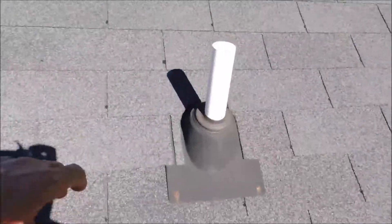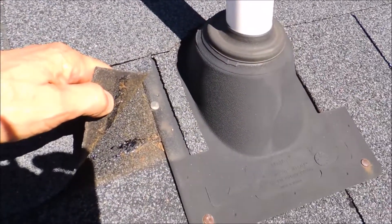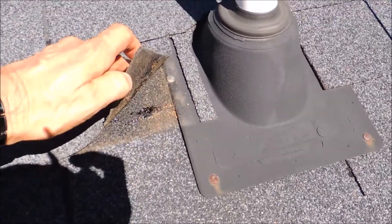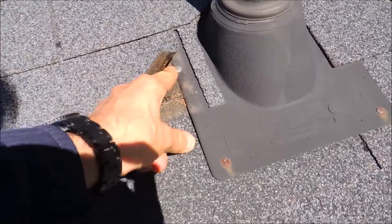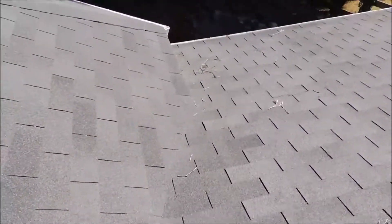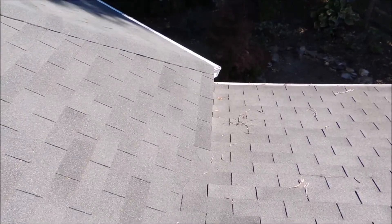Here's another example — this pipe flange, see there's a nail right there and it's practically right in the middle of the key. So again, with a heavy rain the water will seep right through the side of the nail and then travel down the roof in between the shingles and the felt, then it will hit the valley and just travel down, and wherever the water finds an opening like a tear in the felt, that's where it will settle.